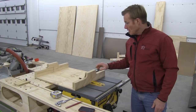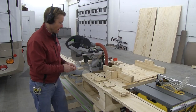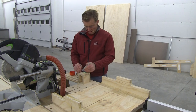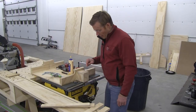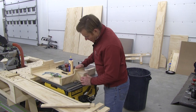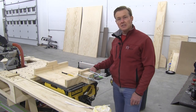I'm squared up and ready to go, but I want to build a guard first. I took some thin metal blades to have it riding just slightly above the table saw surface so there's no added friction, and I've glued the front edge. After the glue on the guard dries, the cross-cut sled will be ready to go.